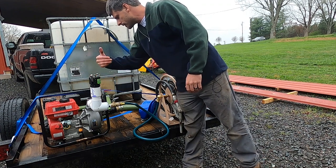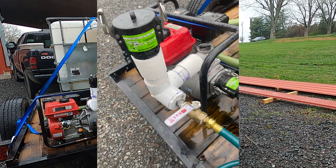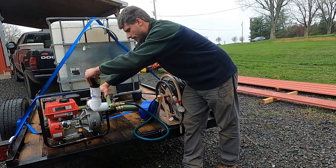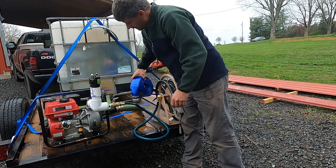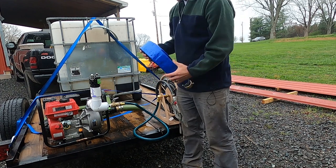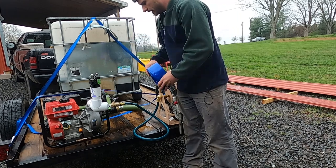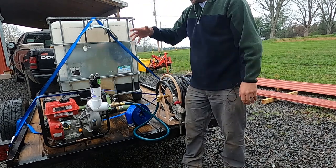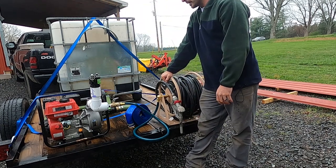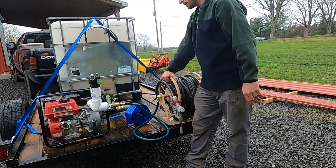We've got a two-inch inlet and two-inch outlet, and we're making ourselves a little manifold here. I've stubbed over here going to our feeding hose — I'm three-quarter here, but straight up I'm two-inch. I have one of these Gatorlock fittings on here so I can keep this capped off normally. But if I need to pump from tote to tote, I can grab one of these soft hoses that roll up nice and tidy — I don't need hard suction on the outlet side. That'll quick connect and I can pump to another tote. This pump will move two-to-one syrup really quickly — I can move a full 275-gallon tote from tote to tote in about five minutes.